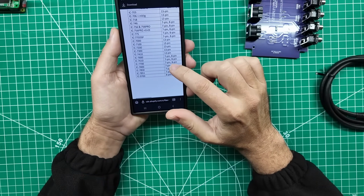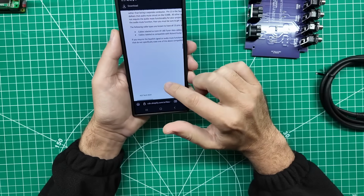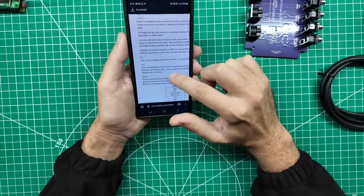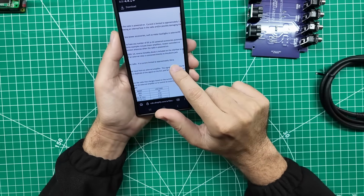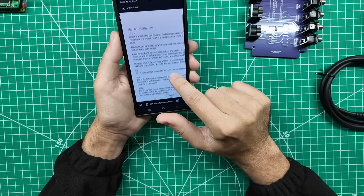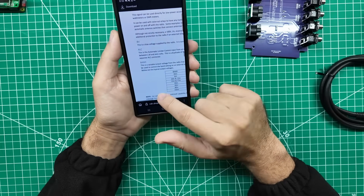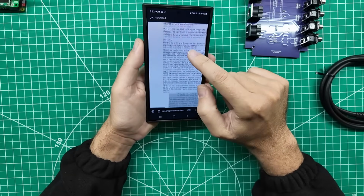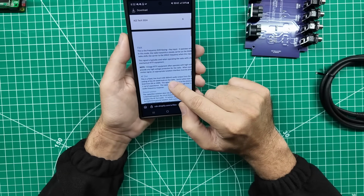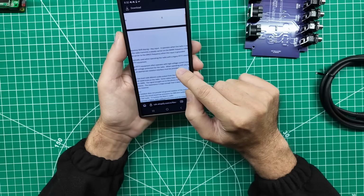There are quite a few different Icom radios here that you can choose from, but we're looking for that FSK. So here's all your different signals. Does he tell you? Yeah, for the 8 volt circuit, you've got 10 milliamps, and for the 13.8 circuit, he says 1 amp. So don't try to pull more than that. There is the band data that we talked about, the different voltages. We're still looking for the FSK. There's the squelch S. FSK is the frequency shift keying key input. This operates when the radio is operating in RTTY mode.